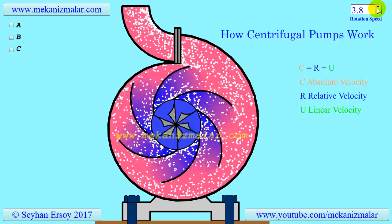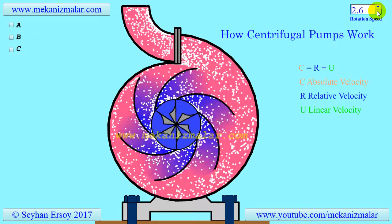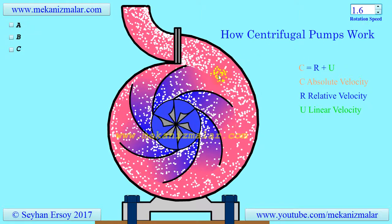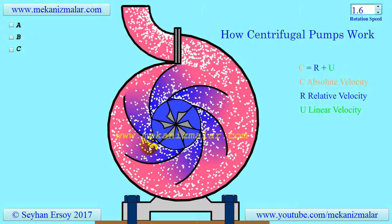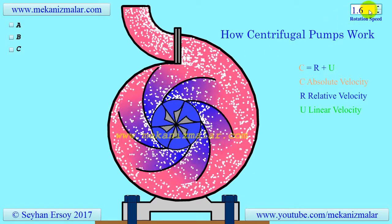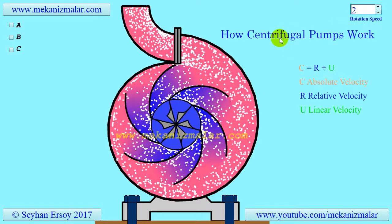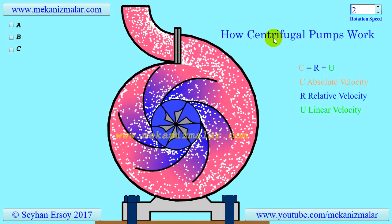As you can see, the input shaft rotates the impeller inside the casing, which accelerates the flow toward the exit. To prevent backflow, the impeller should be continuously rotating. Due to this fact, only a few centrifugal pumps are self-priming, whereas the rest must be primed manually.